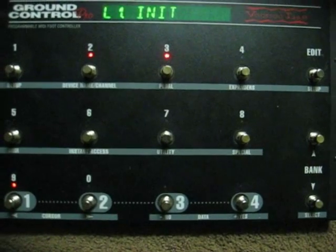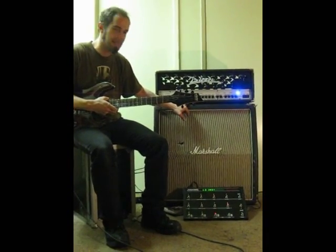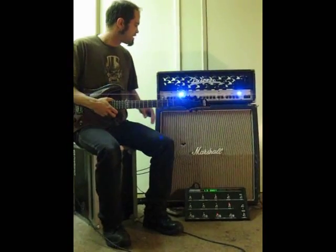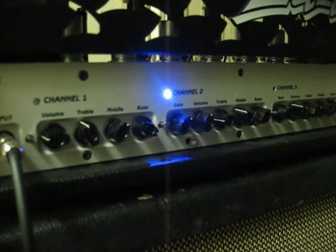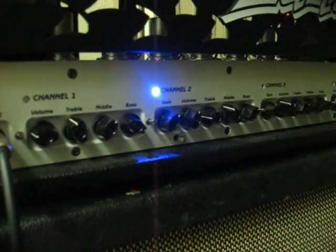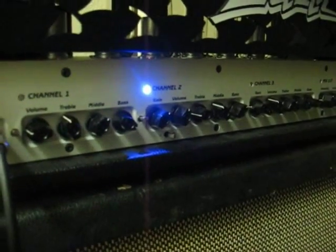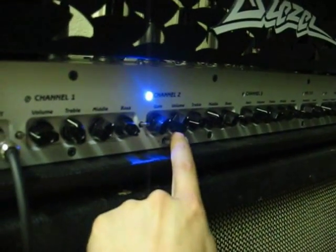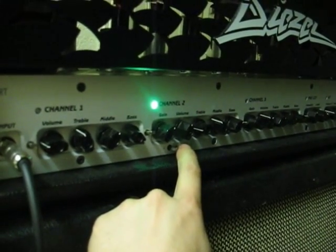And I have a patch programmed in to bring channel 2 in on high gain mode with the effects loop active. Now I want to talk about channel 2. The gain switch gets converted to a momentary type versus a latching type like the stock one. But also the LED gets changed to a dual color type. It switches between blue and green when you toggle between the 2 gain modes. Channel 2 low gain is green mode, and channel 2 high gain is blue mode.